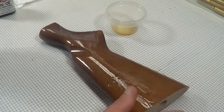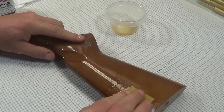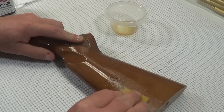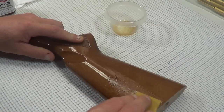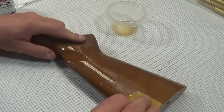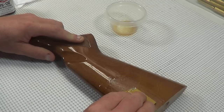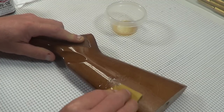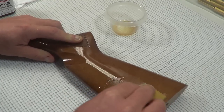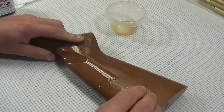I already have some 220 grit sandpaper. Once we have a relatively thick coat down, we're just going to work that sandpaper around into it. You don't want to burn through the finish or your old Tru-Oil too much — you basically just want a slurry to form where you're working. It takes some feel and practice. You can make a mistake and always go back and restain if you had to, but we're definitely not trying to do that if we don't have to.